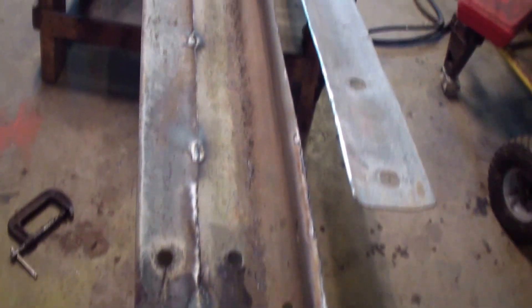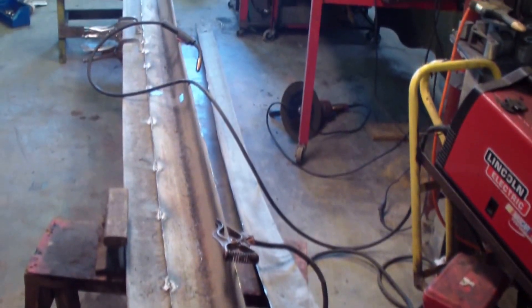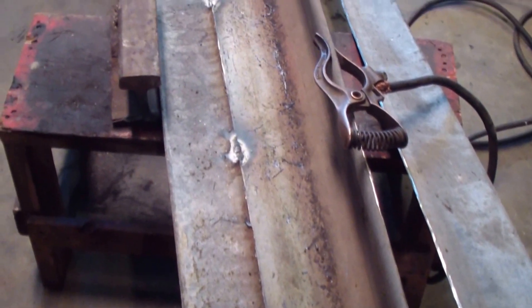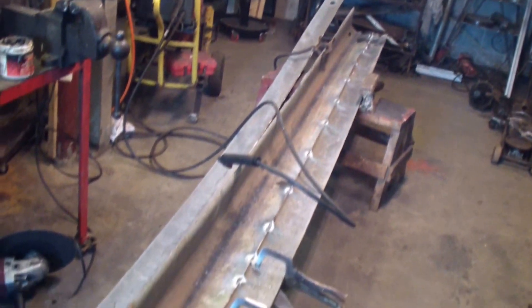What I did was cut it — it had an S-shape to it and this part was the opposite way — so I cut it along there with an angle grinder cutting wheel. Now I'm welding it on and tacking it. It's galvanized so it's nasty stuff to weld; smokes like crazy and supposedly makes some people sick. I keep it well ventilated. They say it makes you nauseous and that drinking milk helps, but I haven't really had the problem. I try to stay out of the smoke.